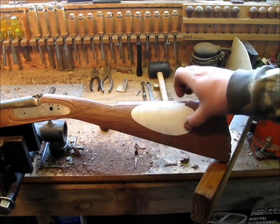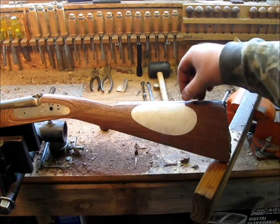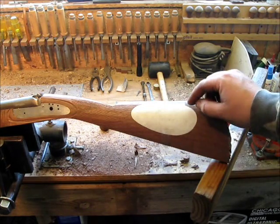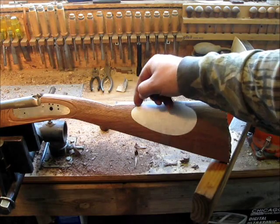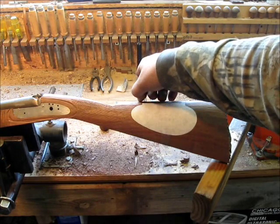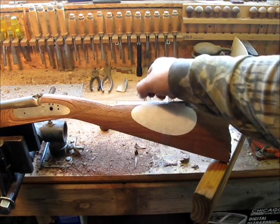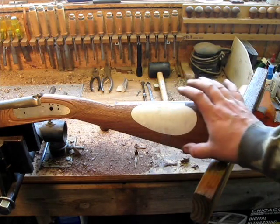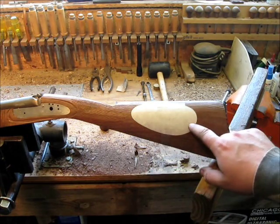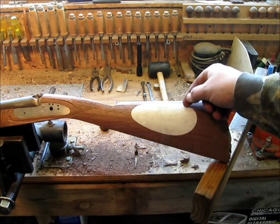I took a piece of paper, traced off the cheek piece from my original drawing, and positioned it on here with a couple pieces of tape. This is part of the cheek piece up here — this is just a straight reference to give me an idea of where it's going to go. The cheek piece will actually stop at each corner here. For positioning, most people when they shoulder up a stock, their cheek actually runs about two inches back from the front of the comb. So you kind of want your cheek piece to start somewhere in that general area. With English guns, a pancake style is really common — it will be dished down and usually have a shadow line around it, or sometimes a shadow line top and bottom.